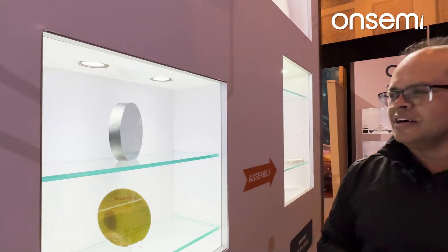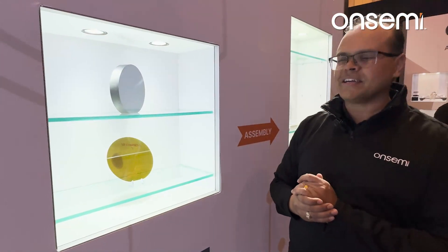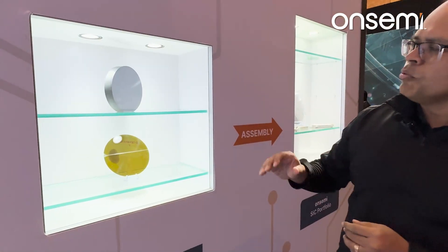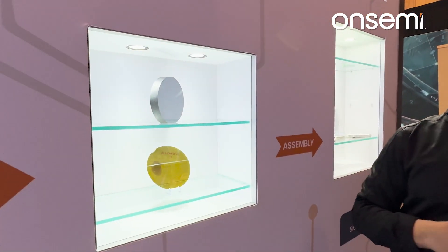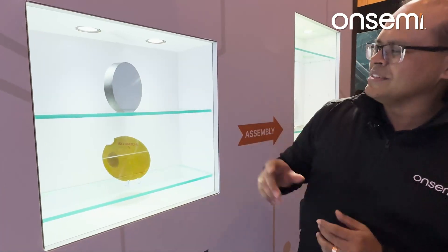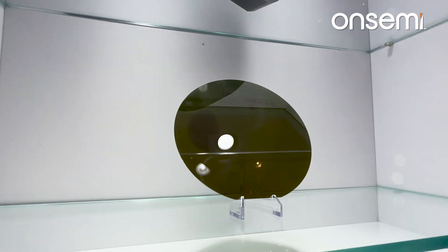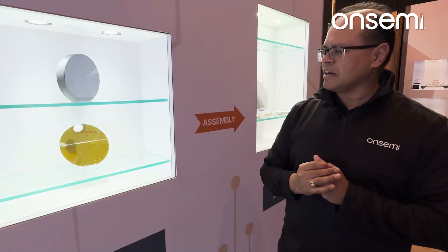This puck is where we can do all of our semiconductor manufacturing. And for those who know hockey, this looks very much like a puck — basically an overgrown hockey puck, which is why it's called a puck in this form. This is the output of our factory in Hudson, New Hampshire, and they send it to our factory in the Czech Republic. There, we do what's called wafer splitting — we take this puck and split individual super-thin wafers out of it. The puck is several centimeters in height, and the wafers that come out are much, much thinner. We get many wafers out of each puck.